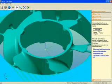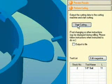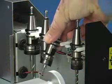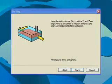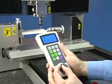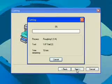Once the toolpath has been created, you can preview your model and see an estimated cutting time. Select Start Cutting. Confirm tool size and install the tool. Or if you have an automatic tool changer, simply install the tools in the tool holder and place in the magazine. Next, set your X origin at the position shown. The easy-to-use handy panel simplifies this process. Press Start Cutting to begin milling.